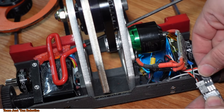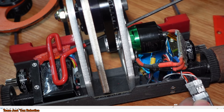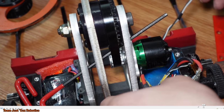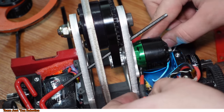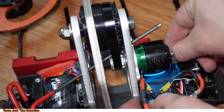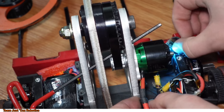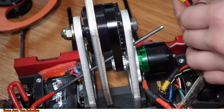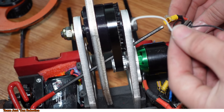Trying to figure out what was going on, because it seemed like it was just a signal disconnect to that drive speed controller. It would be this guy. Oh, shit. I see the problem now. Connection broke on the speed controller itself. Look at that. That white wire is not going to anything anymore.